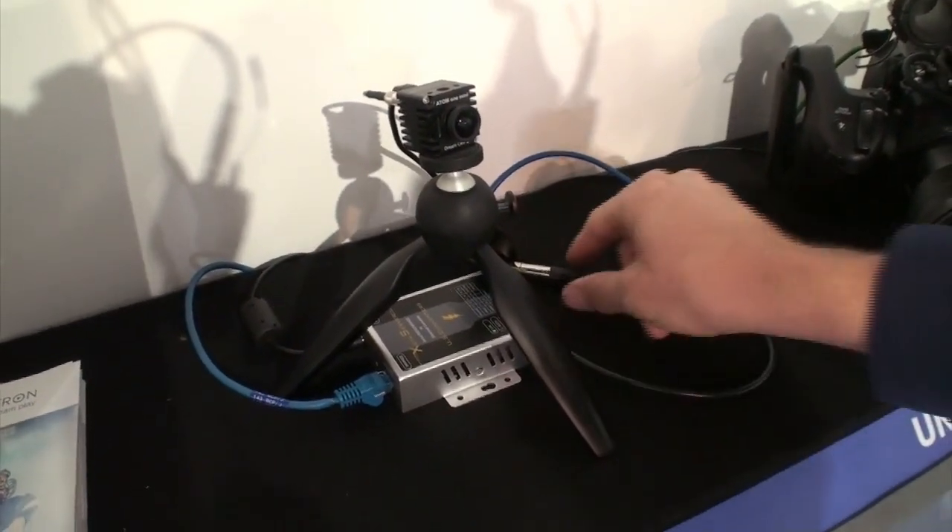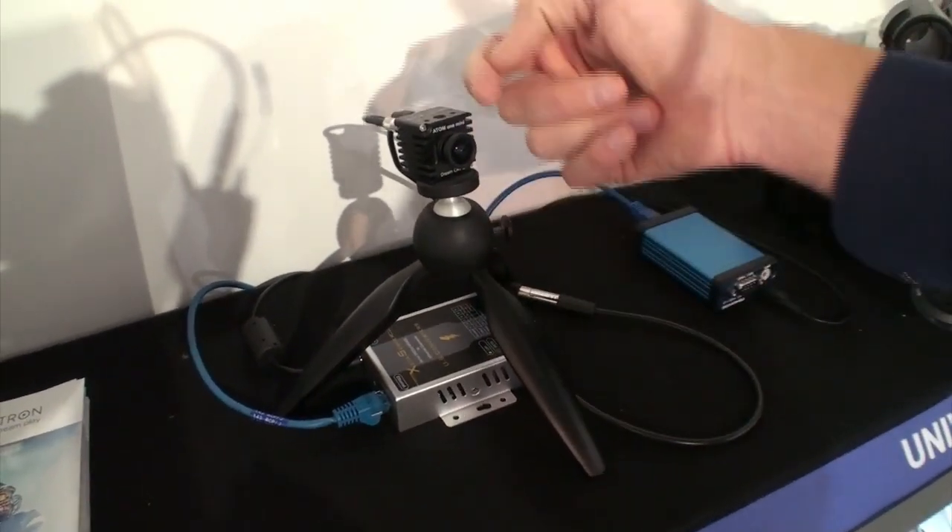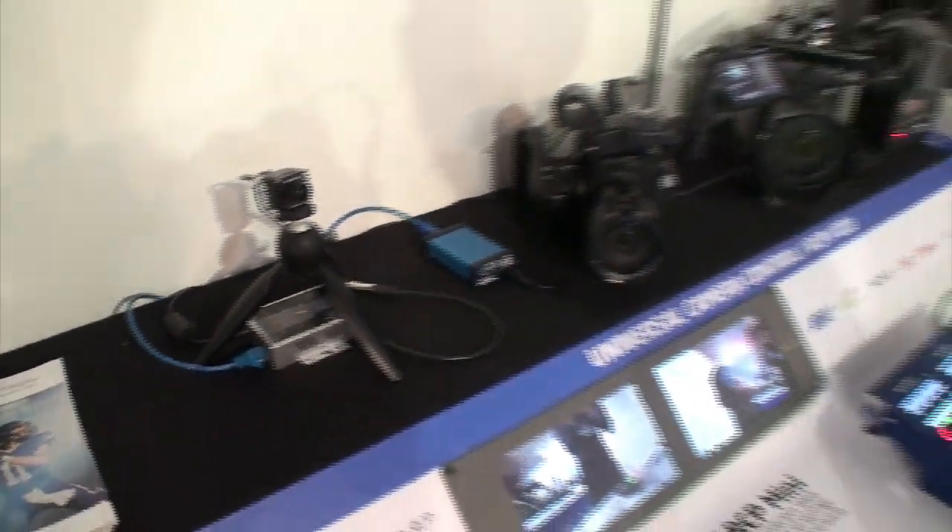Signals can flow forth and back between the cameras and the RCPs. That methodology is how we approach controlling serially controlled devices — including Visca cameras, for instance — using a converter box, so you can keep a clean IP-based infrastructure for the rest of the installation.